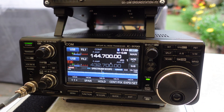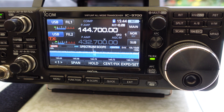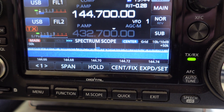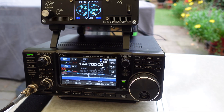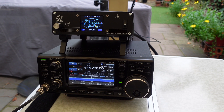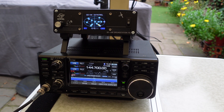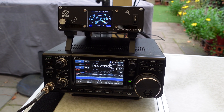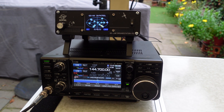The 9700 is in sat mode, and so the TX and RX will track so that I'm able to operate efficiently — and basically that's how it all works. It is a nice little setup. Ideally I'd like to be able to connect that using OmniRig onto my Log4OM logger, but the sat mode facility doesn't seem to work properly, so I'm looking at other ways of being able to sync my PC with the same frequency so that I can do that.